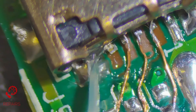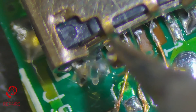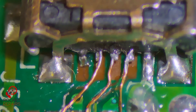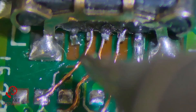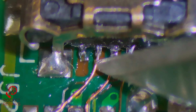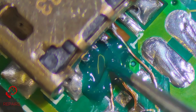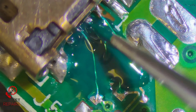And are we looking good? Yes, we are. This pin far on the left is the one that somebody said needed to be connected to ground — it doesn't need to be connected to ground. However, I will just apply solder for you. And now that pin is connected to that pad — albeit not pretty, but it's connected because we just put some flux there. IPA and a little brush. Just whilst I'm here, I just want to get that pin on a little bit more. There we go, perfect — much better. I also want to make sure that one has enough solder on it. Nudge test — make sure it's nice and secure. Yeah, it's fine. And I'm just putting conformal coating in between here and down here to ensure we have no dodgy bridges or connections where not necessary.